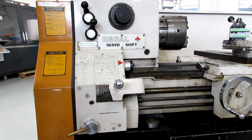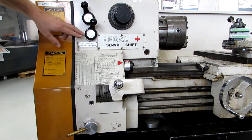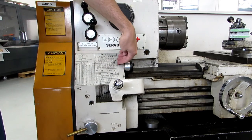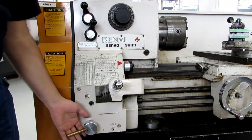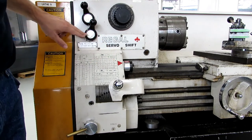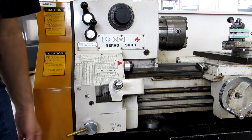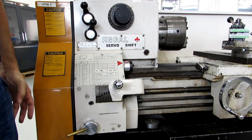Changing feeds on this machine is relatively simple. You've got three handles to worry about. This one is labeled E and F. On the feed chart, E and F is right here on the side of each of the feed charts. You also have the ABC handle, which on the feed charts gives you an ABC range for the E handle and an ABC range for the F handle as well. Someone broke the original ABC handle, so we have this kind of cobbled-together one that doesn't work super great — I'll see if I can come up with a better replacement.